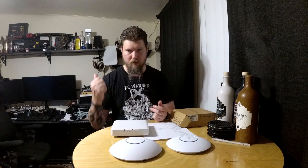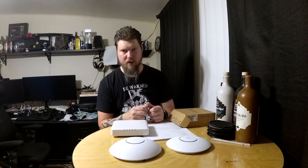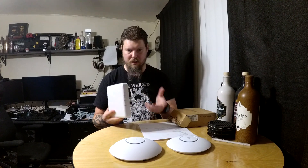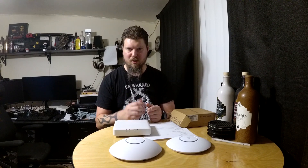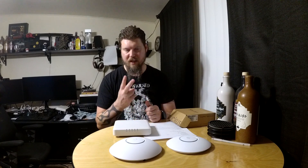The switches aren't that great for the money either — they're decent but not fully featured. The access points are good, but they're not the best. This Ruckus R600 is better than both Ubiquiti units by a long shot. At work, we replaced Cisco access points — which ran for five, six, seven, eight years without dying unless struck by lightning — with Ubiquiti units on some outside point-to-point links. I've put up seven pairs, 14 total, and two have already failed in one year. They're cheaper, and even replacing one a year is still cheaper than Cisco, but be wise about what you're paying for.